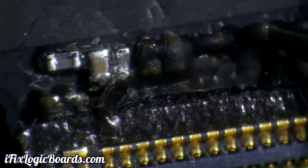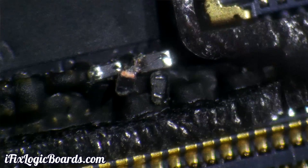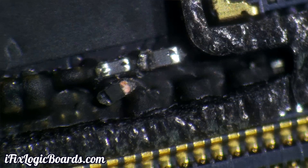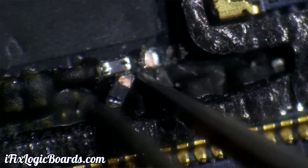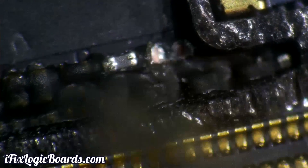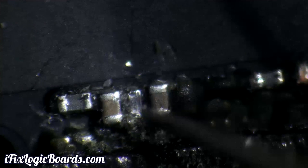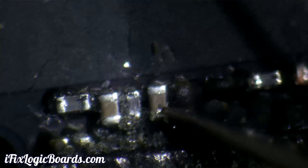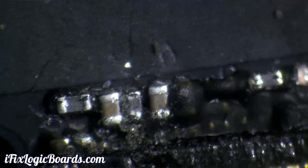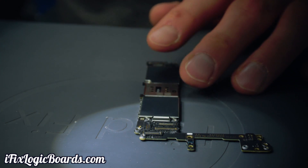These actually look fine. Then I believe one of them is over here — oh, this one, you see? This one just fell apart on me, and that is the same line. So let's go ahead and remove it. We still have the short. So right now I could remove the filter just to check on which side the short is — whether it's on the chestnut side or on the connector side — although it's just this capacitor here. I would replace that filter anyway because it was probably pushing some power through, so let's just remove it.